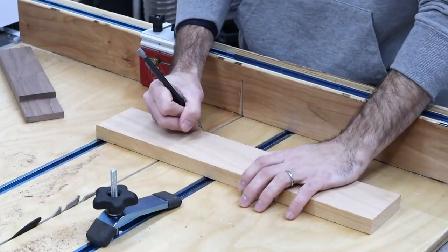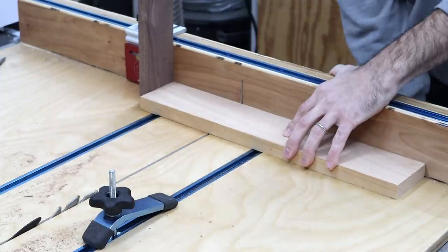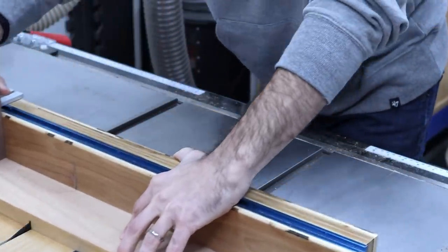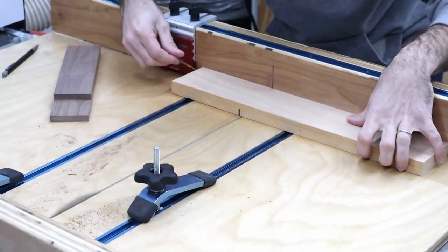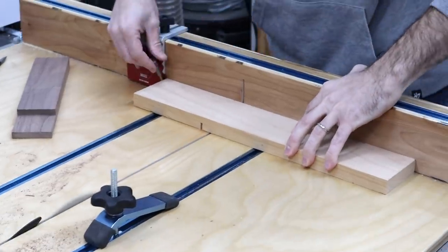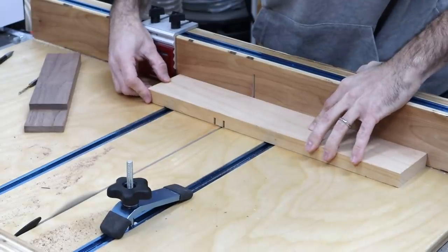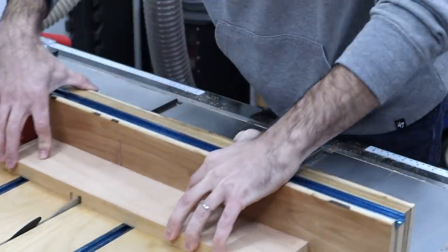Chris and Sean at FourEyes had a really great tip in a recent video about using a drill bit instead of a kerf maker on your table saw, and it's so good I think it's worth sharing again. Let's say you're trying to cut a dado. Simply line up where you want your dado to begin, then using the same material that will slide into the dado as a spacer, place that on the side of your piece and set up a stop block. Make a cut, then remove the spacer. Slide your workpiece over and add a drill bit in between your workpiece and the stop block — the drill bit should be the same thickness as your blade kerf, mine is an eighth of an inch. Finally, hog out the remaining material. Bada bing, perfect dado.